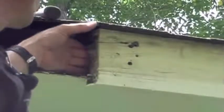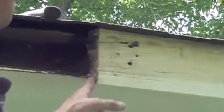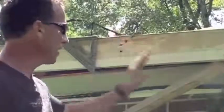We have another problem with the seam not being on the rafter. If the seam is not on the rafter, then this can separate, which you can see by all the darkness back here. It already has done that, and that's why we had rot in here. Now that I marked my line, this is where I have a rafter behind it. That's where my seam is going to be.